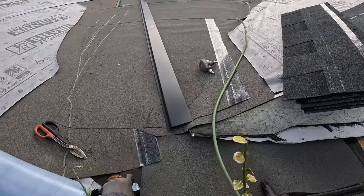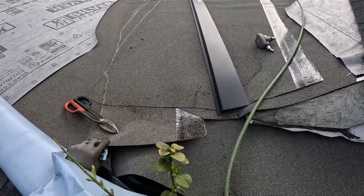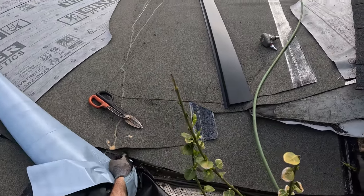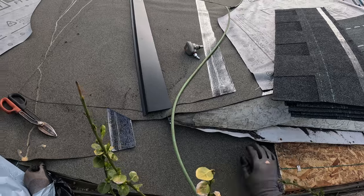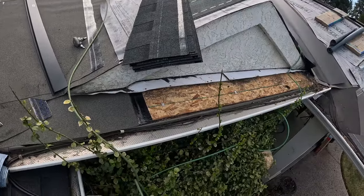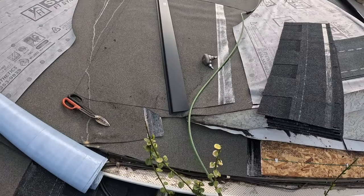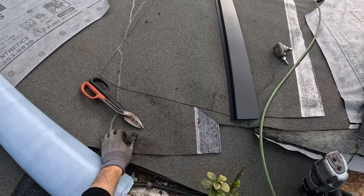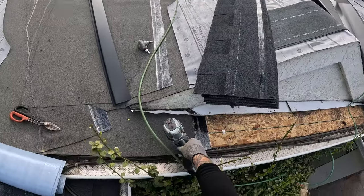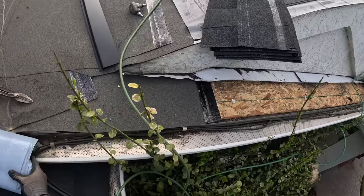I'll tuck a little piece under here. Water flows down so you've got to make sure you have coverage over the metal here on the joint of the valley — that's what I'm talking about. That way when this metal comes down it lands on this, et cetera. This is all going to seal up so tight anyway. Let's get this kind of flat. Up here you don't need to nail the heck out of it — just enough. Got another little piece from here.